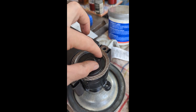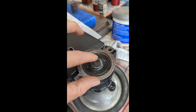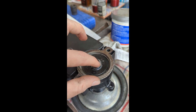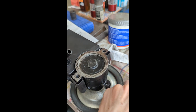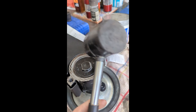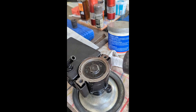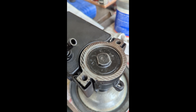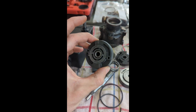Note that this won't immediately release — it's only held in by friction against the side and maybe a rubber seal beneath it. If you're doing this for the first time and your pump is 30 years old, it'll have more resistance due to a build-up of gunk and grime. Keep hitting it with a mallet — not a hammer, as that will damage things — until it starts popping up proud, at which point you can shimmy it out.